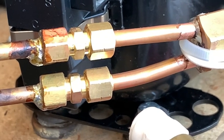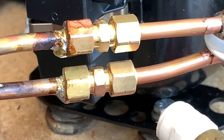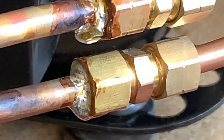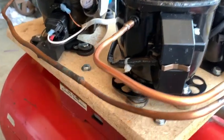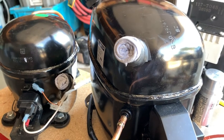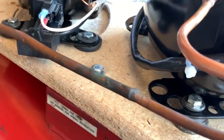The copper tubes are utilizing compression fittings, which work well when the tubes are new. On the other side, I had some older tubes that were slightly out of round, so the compression fittings would not crimp down and create a good seal — I had to solder it, which didn't come out very nice but got the job done. It also gives me a place to disconnect and re-plumb once the new check fitting arrives. Here we have the connection to the compressor itself, with inlets where I made some filters utilizing cloth because I couldn't find any filters that would fit.